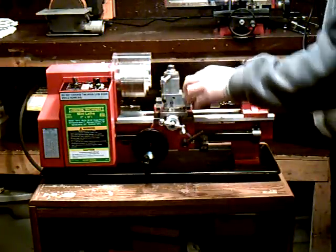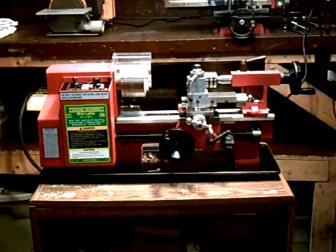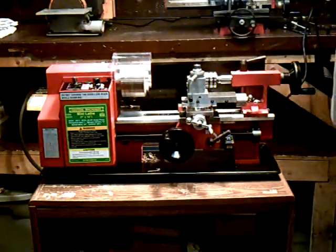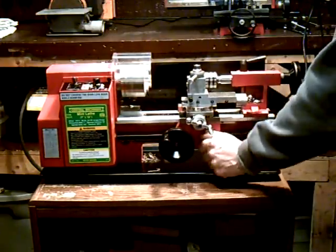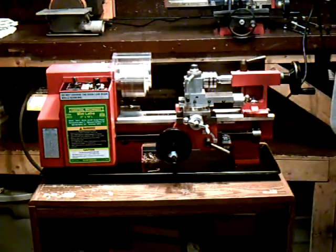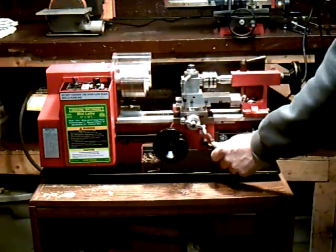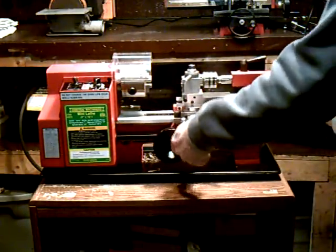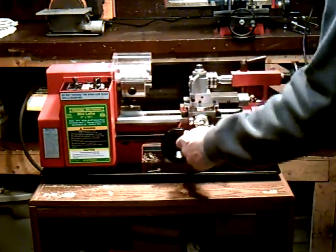You've got your main compound and the main feeding rail. It's got power feed — I don't use it too much, but it's pretty easy to engage. There's a lever on the back where you can keep it on or off. Engage it, put this lever down and you'll see it start spinning by itself. You've got to be careful never to run it too close to your chuck — simply lift the lever up to stop it. It's nice to have for doing some threading, which this machine can also do.